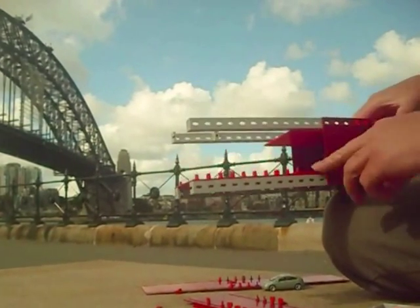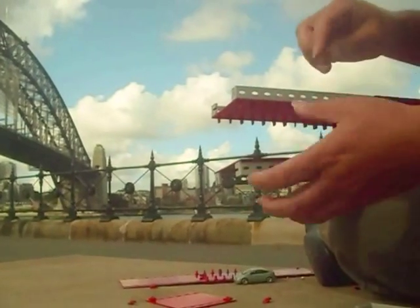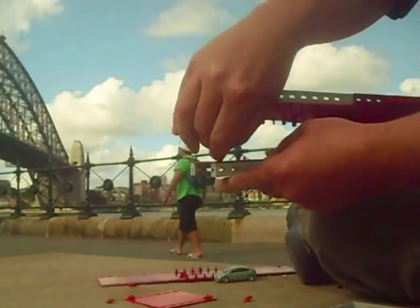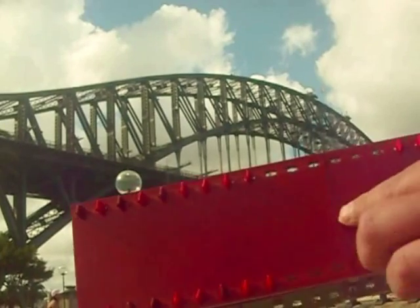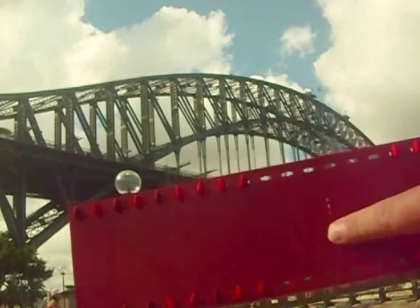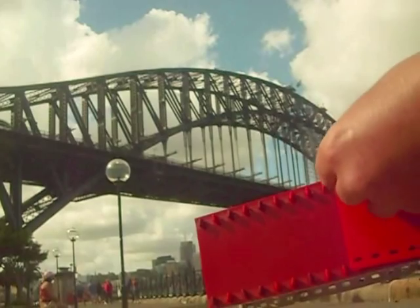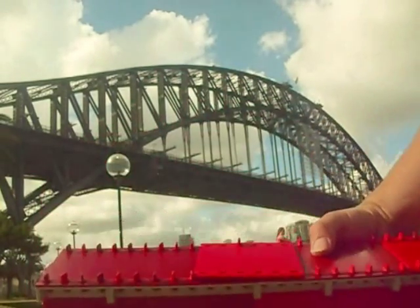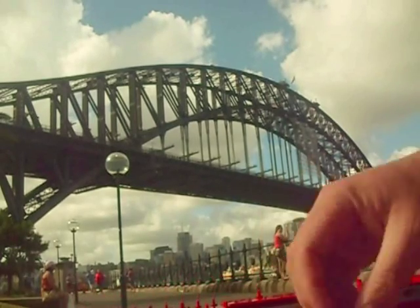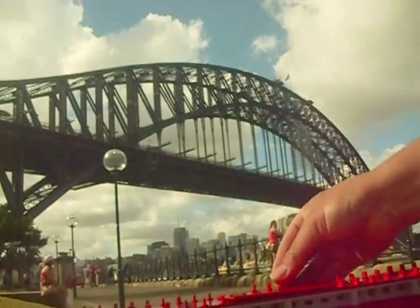See how the plates are doubled up at the joints. Notice where there's a joint - they put an overlapping plate, then you have longer rivets. Some of the rivets in the bridge were over a foot long because they stacked up so many plates where they needed extra strength. They needed to be that long to get them all together. I must admit I'm dropping rivets all over the place here - mind you, they dropped a lot of real ones as well.